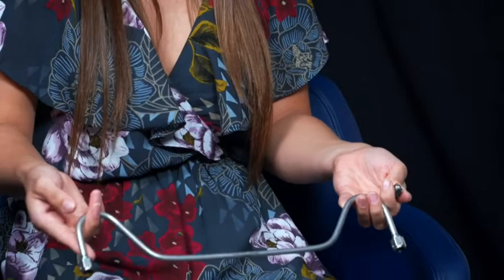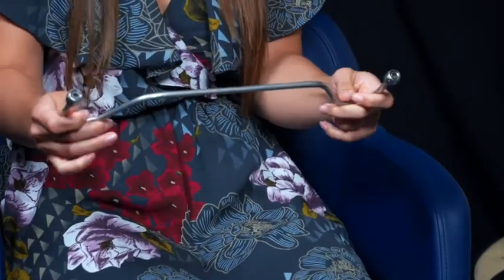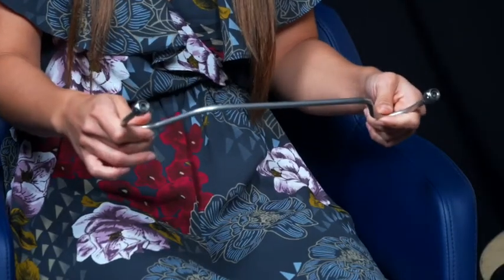We do get pretty crazy with these. They can go very long — we have some assemblies that are up to 13 feet long. Some of them have multiple cable diameters. This is one of our largest cable diameters — this is 270 diameter. We have a wide offering of about five cable diameter sizes right now, but you can actually integrate multiple diameters together depending on needs. We've even had some assemblies with loops in them, which are quite challenging to make. Cables are sometimes the last thing designed, which is why we get all the interesting configurations — they're actually designing the cable connection after the rest of their design is done.